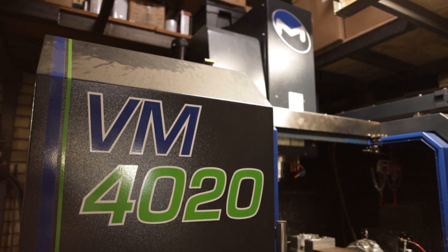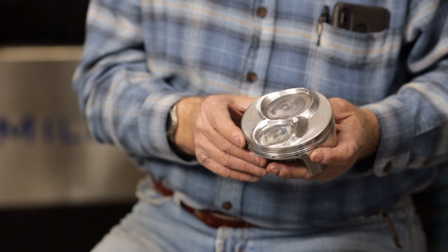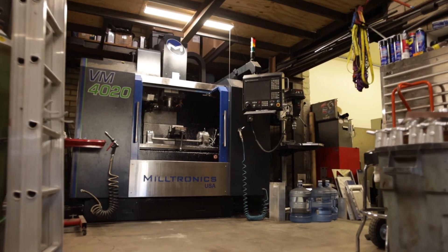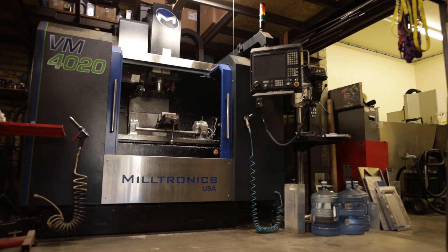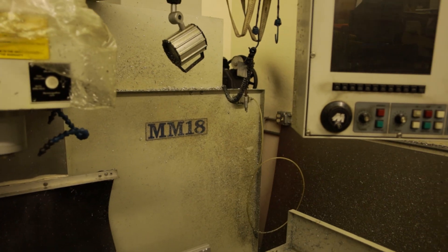Tolerance and finish of the parts we're making — the finish is kind of an artistic thing, and people really like the way our stuff looks. That's part of the programming, part of the accuracy of the machine — the combination of the two to produce that. I'm not building mil-spec stuff, so I don't have to go to tens of thousands in accuracy on an intake manifold, but it certainly has to be within a thou or two. It's plenty accurate enough for the kind of things I'm doing.